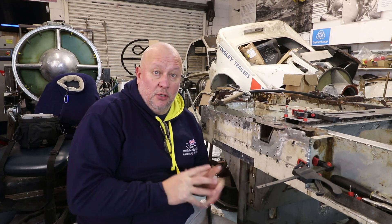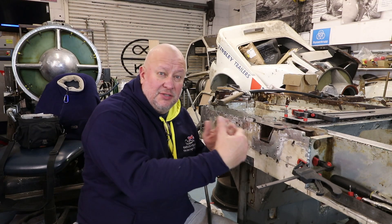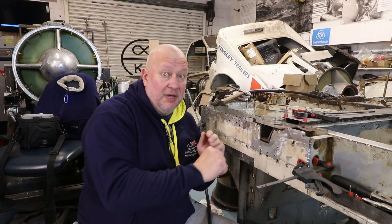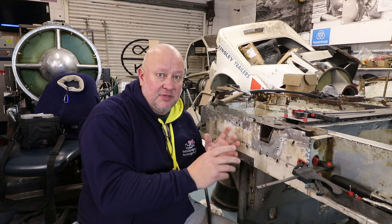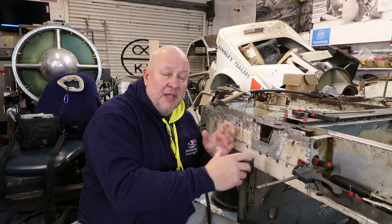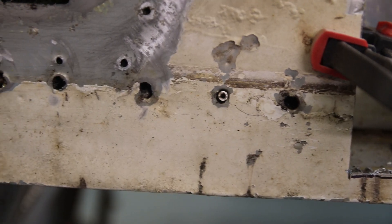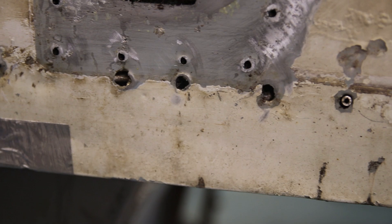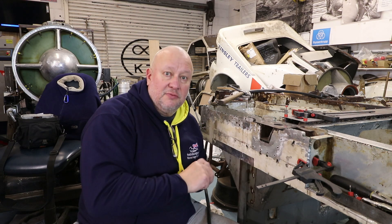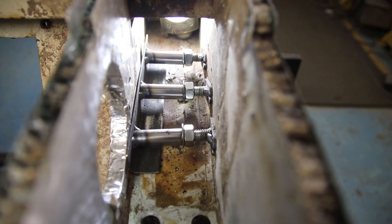This area of honeycomb was dished. What we've realised is that when it's just a dish, it's not one single failure — it's many hundreds of tiny ones from the honeycomb, and because they're tiny they don't mind being pushed back. So we used an old trick from the Bluebird project and made up some small screw jacks to push that side out. A tweak with a spanner and a tap with a hammer and out it came. We left the screw jacks in, then injected resin into a conveniently spaced set of old rivet holes to consolidate the honeycomb inside in case it had moved.